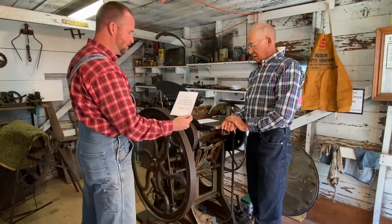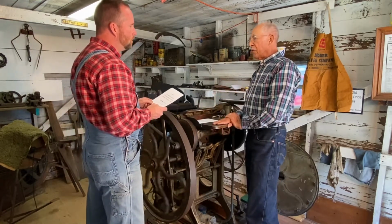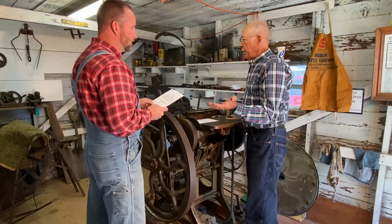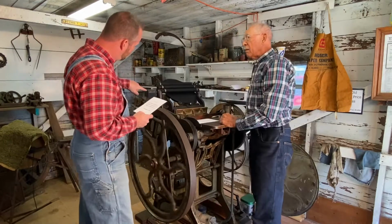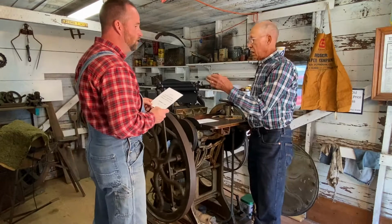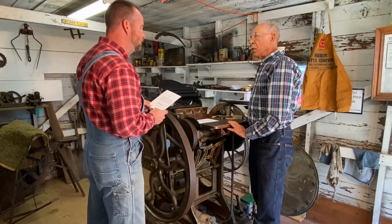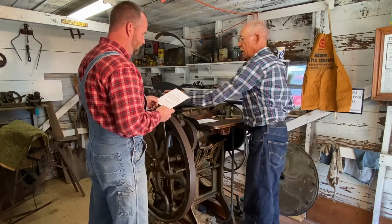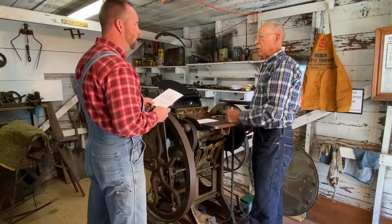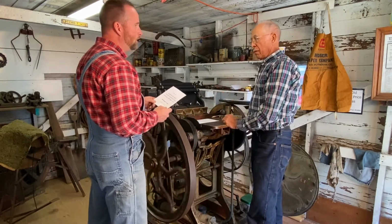Look at that. So if you need numbers, several of them, and you say you needed 100, there's a counter right here that you can set, and it'll count up just like this little numbering machine right here. That numbering machine will tell you how many you have printed, that way you know how many you make. Every time you take the clutch off, it stops the numbering machine from counting. So you only print when you have the lever back to engage the print.